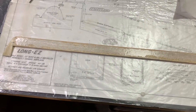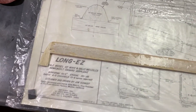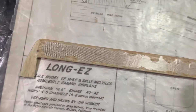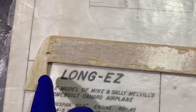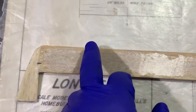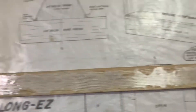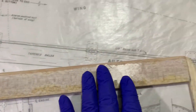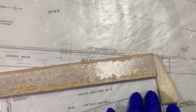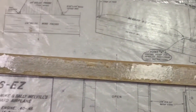As we continue our update here, we're looking at the top of the canard. We've got our fiberglass in place. Once again, the 3M77 — lay down your fiberglass, use a little thin CA here on the leading edge and the trailing edge, and then we'll go ahead and brush on the Hysol 120 epoxy — 120-minute, 2-hour epoxy — and we'll let that dry overnight. More to come.